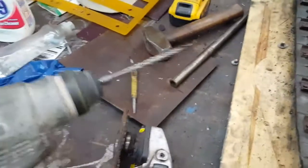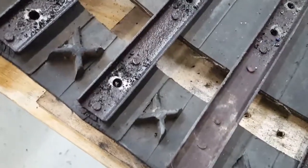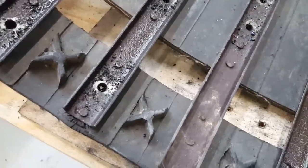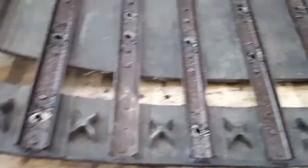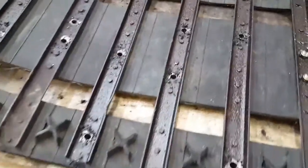I just have it in drill mode — not using it in hammer mode, just drill mode. You drill through your cleat, and what's nice is the drill bit actually gets hot as it's going through and it kind of melts its way through the rubber. That's good — it seals the rubber up nicely. I was spraying some lube on there to help cool the bit down.